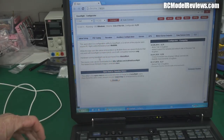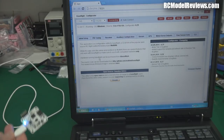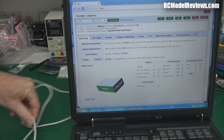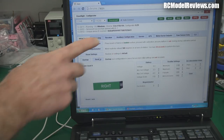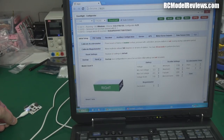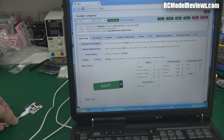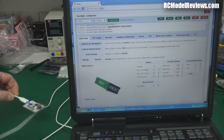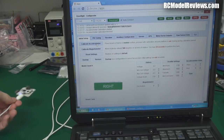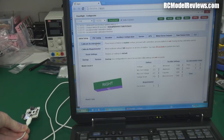So we plug in the board — the little lights will flash, and it says 'connecting,' then 'disconnect' because we are now connected. The first operation is to calibrate the accelerometer — just click on that and the lights flash on the board and it's done. You'll notice a rectangle on screen — that's our flight controller. As we twist and turn the board, that little box moves to indicate the accelerometers and gyros are all working perfectly fine.